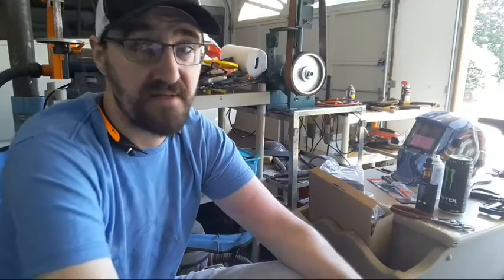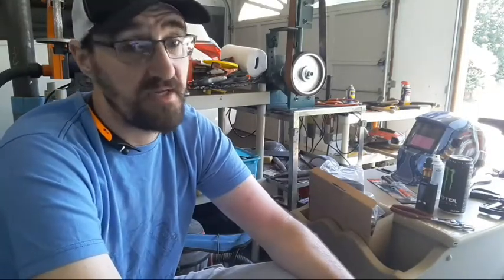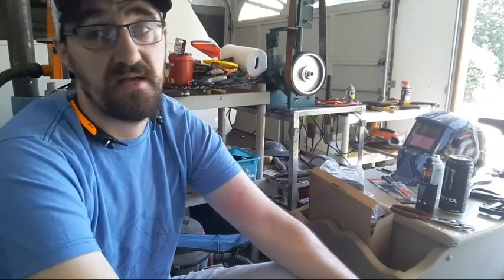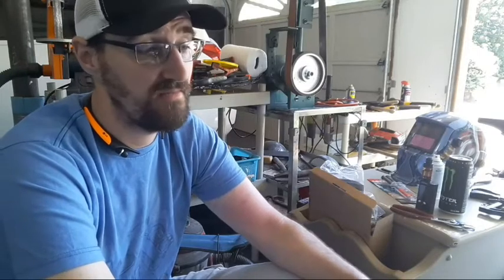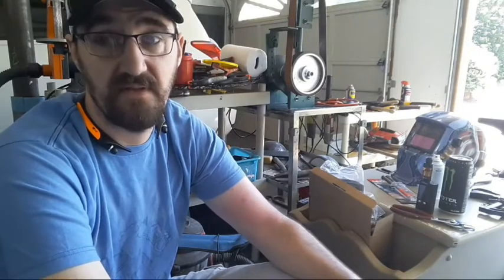It's not going to be fixed at coming out in one spot and nowhere else. So that should make it a lot better. I can put it either right behind me, aimed right at center mass when I'm on the forge, or I can back it off a little bit and get a more general spread. And you know, if the pressure's too low, I can always take some tape and close up the mouth a little bit to build pressure up.